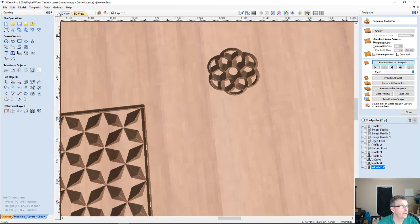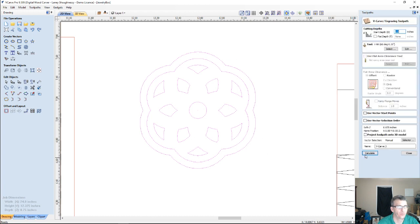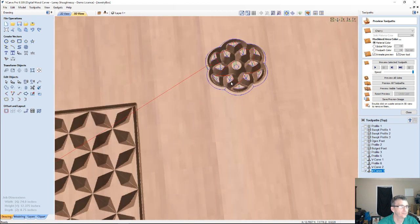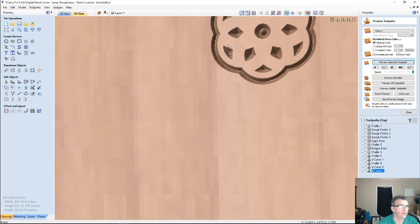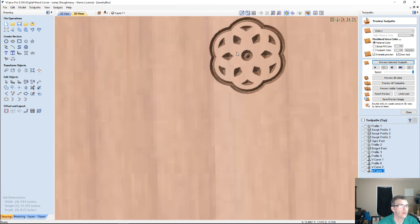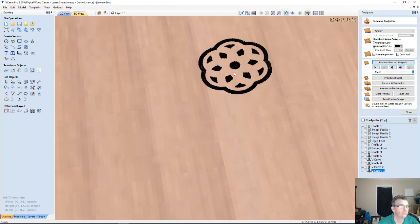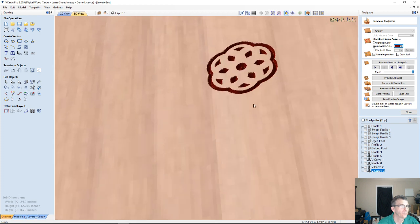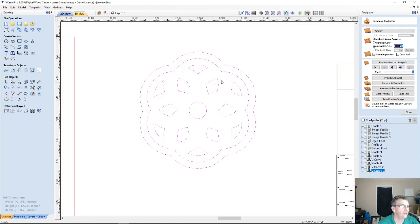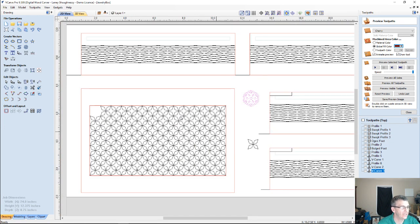But now let's look at it and reverse it, basically by selecting both lines and creating a V-carve toolpath on both, with both lines selected. Let's zoom in here. Let's reset our preview and preview the selected toolpath. So now, this is a small little area here, and go deeper. Let's add a little bit of color in there so you can see that pattern. Not that color. We wouldn't color that black, like a red, maroon, so you can kind of get that pattern. Now imagine that pattern rotated around another 6 times, and another 6 times, another 6 times, until you get this big kind of motif design going on.